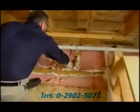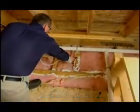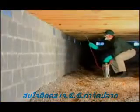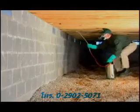In whole house treatments of existing homes, Boracare is applied by spraying, high-pressure misting, or foaming all the wood framing in wall voids, attics, soffits, and crawl spaces. This simple procedure can generally be completed in a day and causes minimal disruption for the homeowner, who can remain in the house during the treatment.